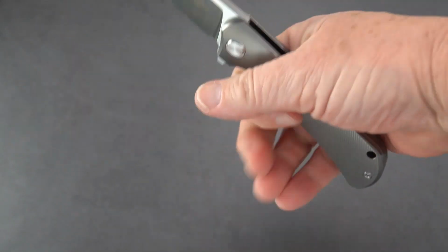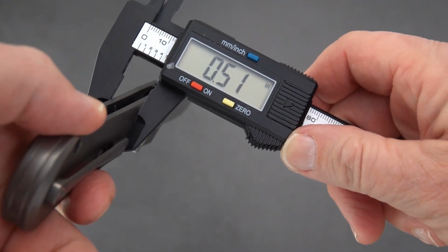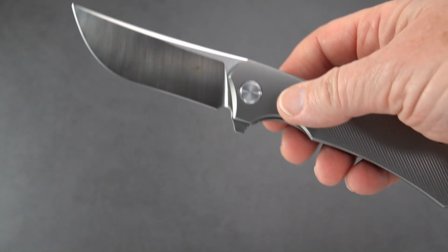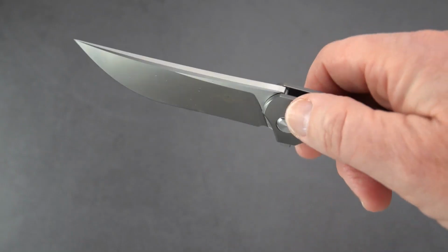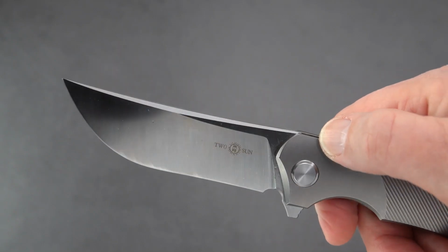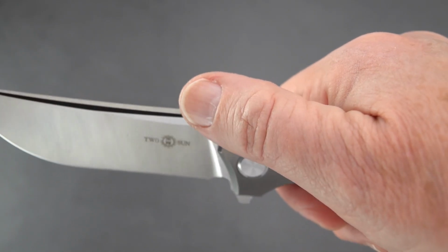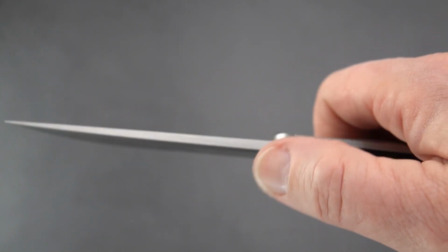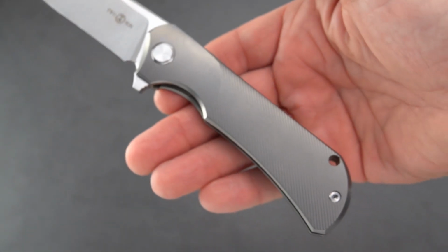Straight back. And did we get a handle? Yeah, I'm forgetting already. Yeah, 0.51. So only about a half an inch. I had not gotten the handle, or I would have recalled the figure. Pretty good at remembering numbers. Not so good at remembering some other things. Got the edge broken here with a bit of a chamfer. Plenty of meat out at that point, as you can see.